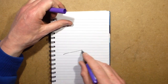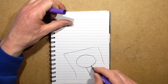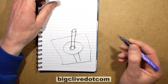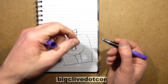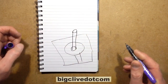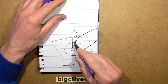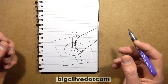If you've got a circuit board with a pad on it, and the hole in the pad and the component lead coming through, then when you solder, you do not put solder on the iron and then carry it over and blob it all around it like glue. It doesn't work like that. What you do is you place the soldering iron against both the lead and the pad, and you heat them both up first. And this all happens very quickly.